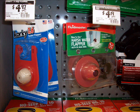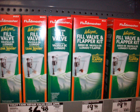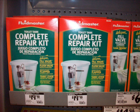There are several parts available to fix these things. You can replace the flapper valves — they're available at the home center. You can even get flapper valves that will increase the capacity of the toilet from 1.6 to maximum. You can get the Fluidmaster valve by itself, or the Fluidmaster valve with a flapper kit, or with a complete flapper kit that includes the seat. I don't really recommend replacing the seat because it raises the water level.